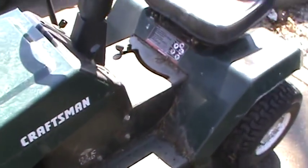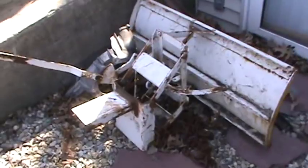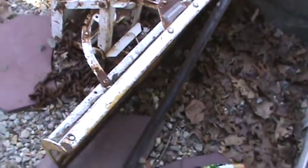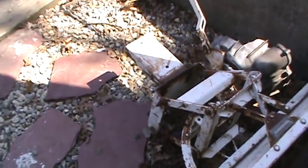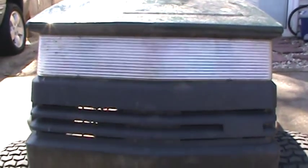I don't care about that deck because that deck is coming off, and this is what's going on it — check this out — nice plow setup. I'm really not sure how big it is, I'm going to say it's probably about three and a half feet. It's going to need a little bit of tinkering and it's not built for this machine, but that's what welders are for. Basically I'm going to cut this plate right here off, make some holes in it, and this will actually attach to the front. I'm going to have to build out this front plate a little bit so we can maintain the light section — I might have to cut some of this out, which isn't a big deal. I'll just use my Dremel and it actually cuts this plastic stuff pretty good.